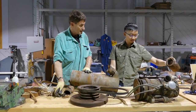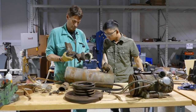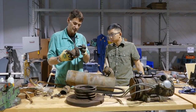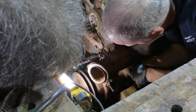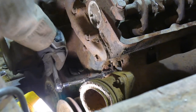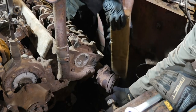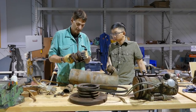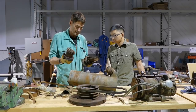In addition, today we did a lot of cleaning and vacuuming. These are the attachments to the exhaust manifold. You can see the remains of it here — that was a flexible piece of exhaust pipe that'd be bolted on to the engine, and that flexible piece of exhaust pipe would flex down to another connection point, bringing it out the rear of the tank, and then from there up inside the muffler, which was strapped on the rear armor of the tank. It's in sad shape, but the flange is there and this type of flexible hosing is replaceable — we can find something similar and just have to weld it back on and match it back up when the time comes.